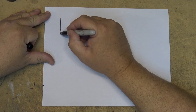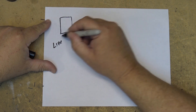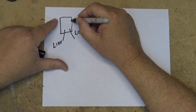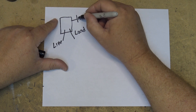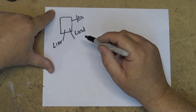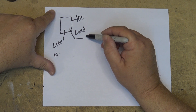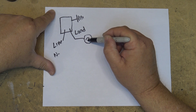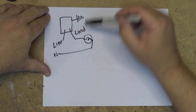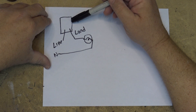The reason this happens is actually quite simple. In a conventional incandescent-only light dimmer, you've got your line voltage coming in, your output wire — your load — which goes to your resistive load, in this case an incandescent bulb, and your safety ground. The safety ground itself is not connected internally to the circuitry. The neutral line is connected through the light bulb, the resistive source, and it provides the return voltage for the circuitry in the light dimmer. So there is a small amount of power flowing through the dimmer itself, going through the light bulb even when the lamp is off, which is what powers that electronic circuitry.